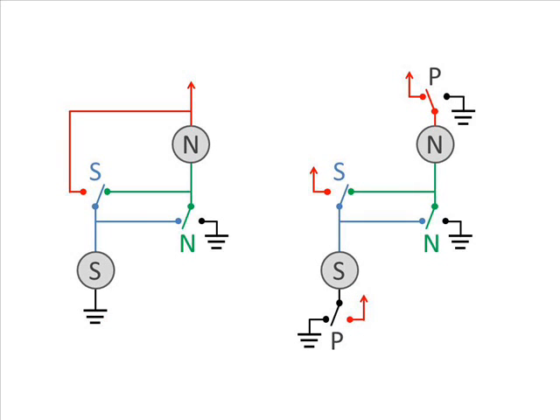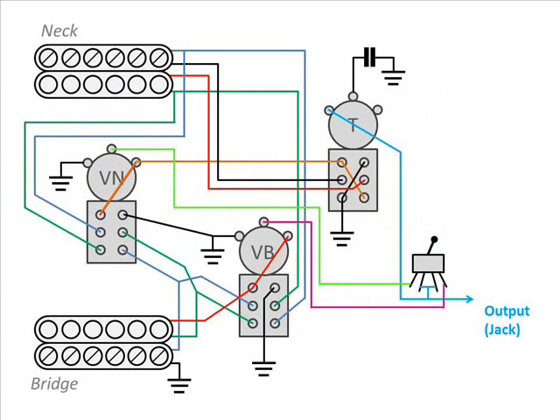To sum up, I propose two circuits. The first one allows you to do coil splitting while selecting the coil and parallel wiring. The second one allows the same thing but also to invert phase. When the phase is inverted, you can still split coils, but the coil choice is inverted too, so that you will still cancel hum when using both humbuckers. With this recipe, you can do everything you want — or at least everything you can do with your on-on switches. Just put the right circuit switch on the right guitar switch. Different circuit switches can be implemented together and it's not mandatory to use every switch. To conclude, I'll provide the wiring diagram I created for my guitar. Both humbuckers are controlled together for coil splitting, and I can invert the phase of the neck pickup while keeping hum cancellation when coil splitting and combining both humbuckers. You will find a more detailed description below the video.